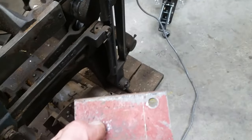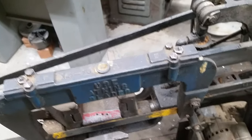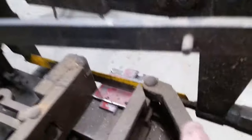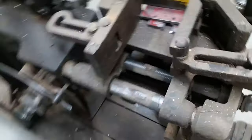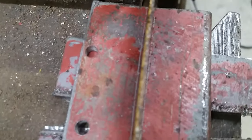It's really nice especially for what I'm doing. I need to cut these in half lengthwise, and the other two saws have the vise set too far back. With this one I can get it up nice and close. One of the interesting double-features on this vise: both sides can be adjusted 45 degrees — this swings out, swings in — and also it centers: one jaw is not stationary, they squeeze together, which is really neat.